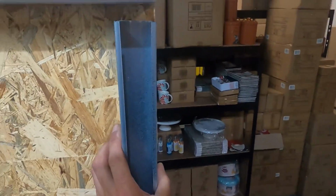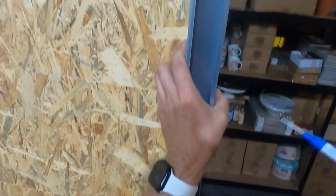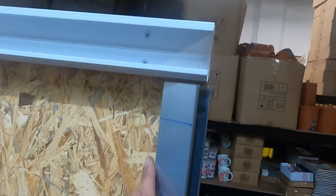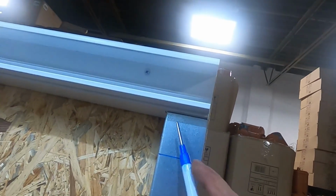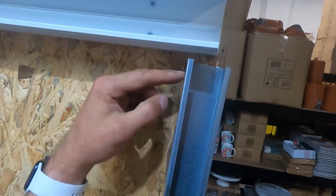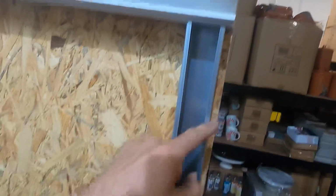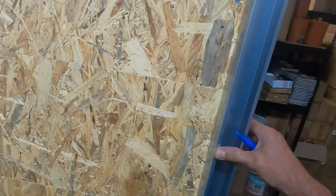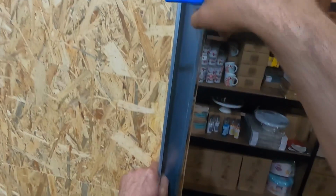But we're going to make the flange out of this bit yet. So what I'm going to do, this is going to come down the side perfectly like that. So it's going to go into this bit of trunking like so. So I'm going to cut that out, and that flange will bend down so it can be clamped on there, and then put holes in the back so this can sit nice and neat on that bit of board, ready to be wired down nice and neat.